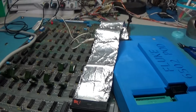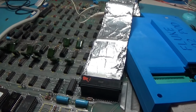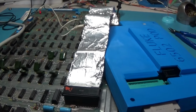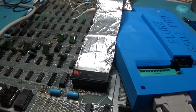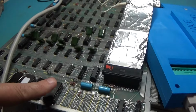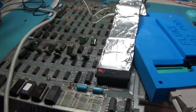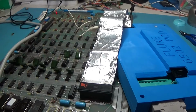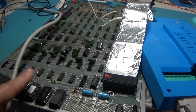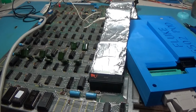So I'm going to go through off camera one more time and go through all of the ROMs, just a sanity check, and then we'll put the regular CPU in it. We're good with the Fluke now. We've got RAM checked. I'll check ROM one last time. We can read our switches, so that's really all I'm doing with the Fluke. So I'll do that, go through these one more time, and then be ready to pop the regular CPU in it and see what it tells us.